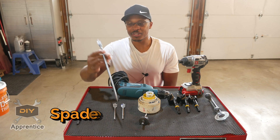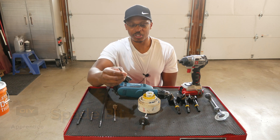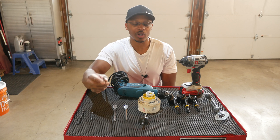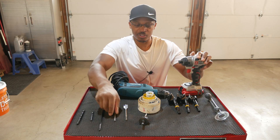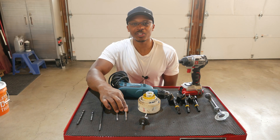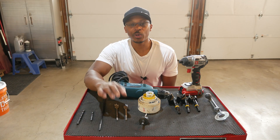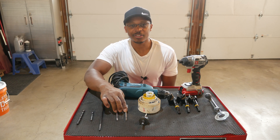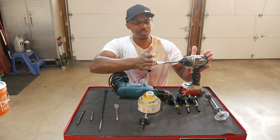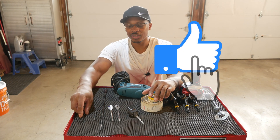The next type of device is a spade bit. I've got a really long one I used on the toilet project. These are both three-quarter inch and this one is thirteen-sixteenths. These are quarter-inch drive and lock in place. I use spade bits when making holes in walls for electrical work mostly — for example, cutting holes in studs to pass wires or screws through. It's also going to depend on how much space you have; a long one might not fit in a sixteen-inch on-center stud cavity.